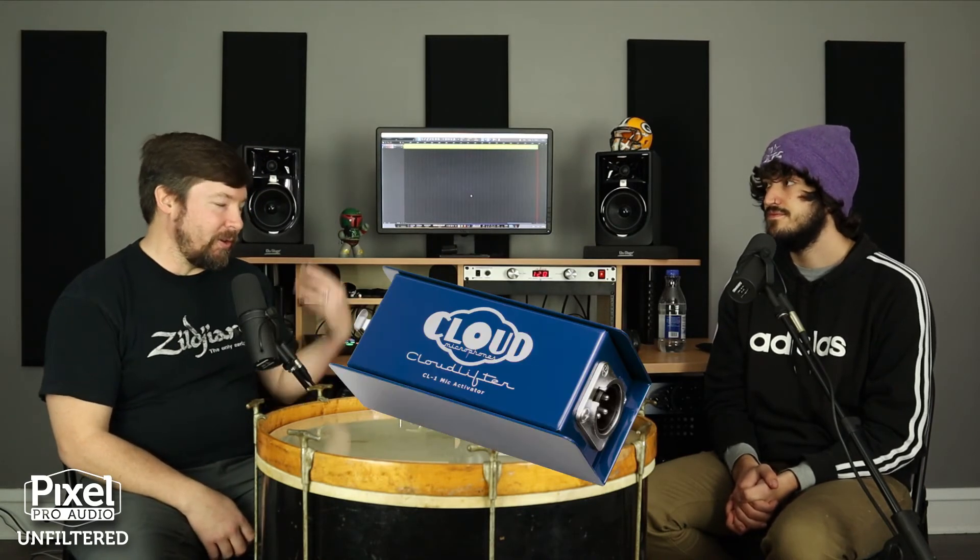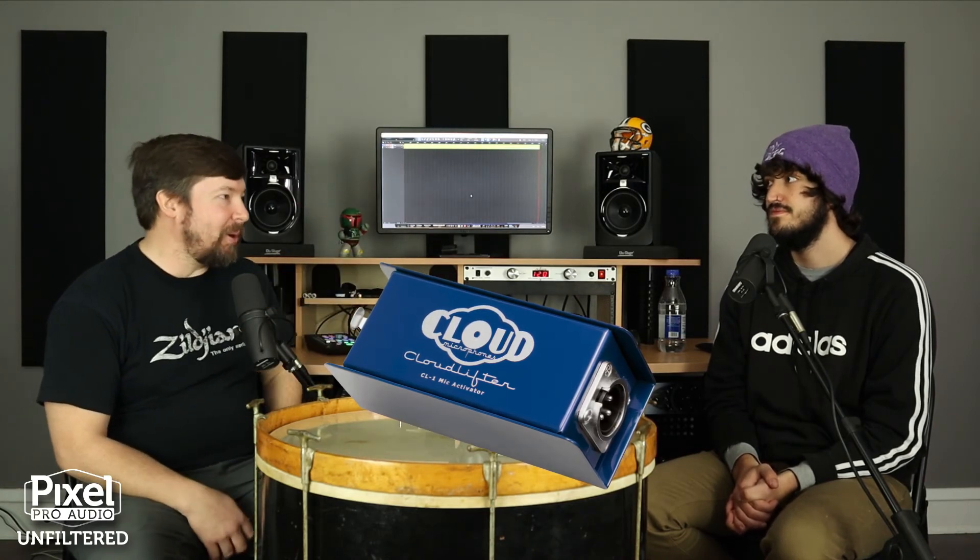That's a caveat and an entry-level hurdle you have to deal with when you get this microphone — you either need a preamp that's able to get enough output gain, or you have to get a cloud lifter or something like it that boosts the signal so you can get that line level up. Do you have one at home, a cloud lifter? I do. It's important to do your research because I did not have one when I bought the SM7B, and I found out pretty quickly that my 2i2 could not handle the gain this mic needed. So I picked up a cloud lifter after one of my professors recommended it to me. I just want to remind everyone that even though these are my favorite mics, they might not be and probably won't be your favorite mics. Every vocalist's instrument is completely different, so it's important to go out and do your own research.